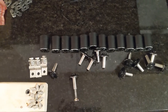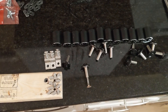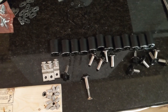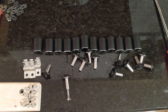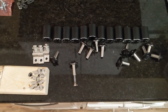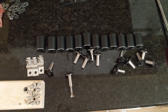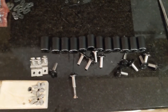The type of solar panels that we got are exactly 59 and a quarter inches, and the AVC RIG roof rack and most other roof racks for the Ford Transit are 60 inches or 60 and an eighth, right around there. So the solar panels we got special ordered from Europe. The reason why is because the type of solar panel that you can get here in the United States is not the right dimensions. You can either get them like 3 or 4 inches too small, or they're 3 or 4 inches too big. The ones that we got are 59 by 39, which means we can put 3 solar panels on there. They're 300 watts a piece, which is going to give us 900 watts.